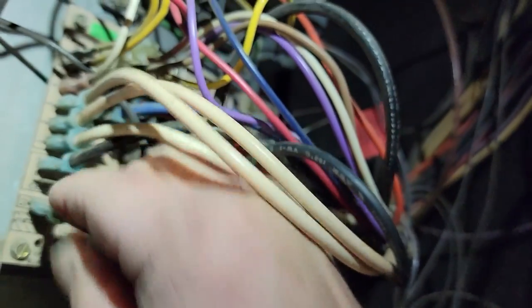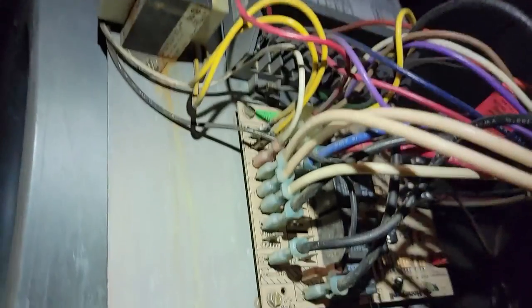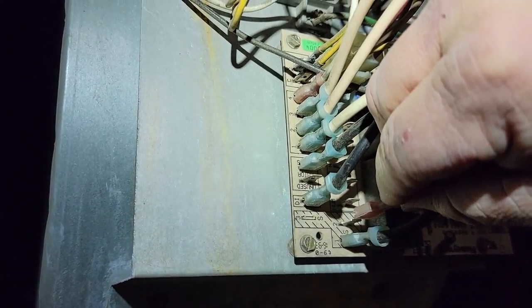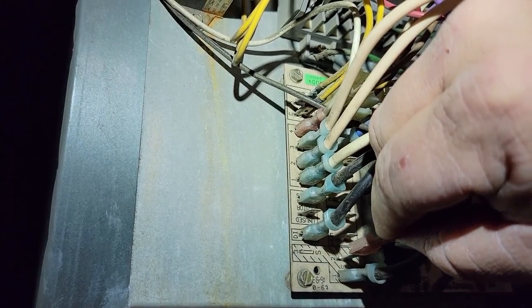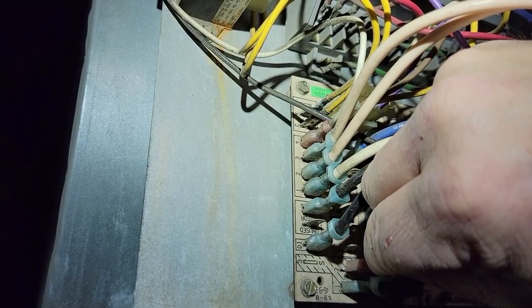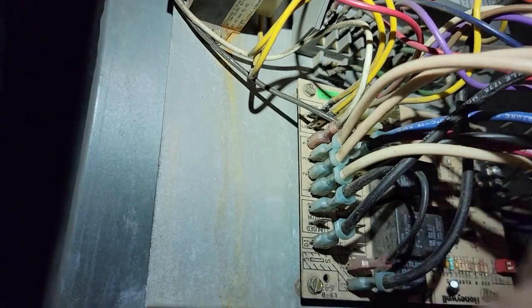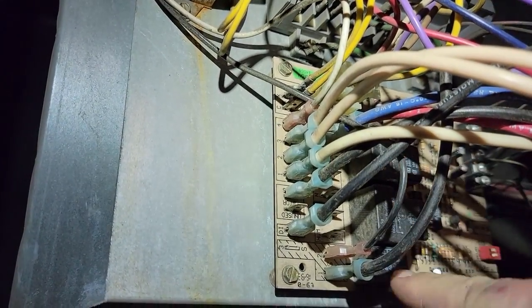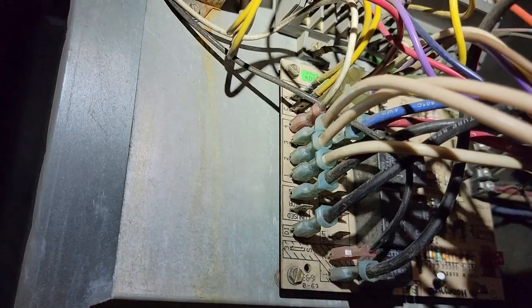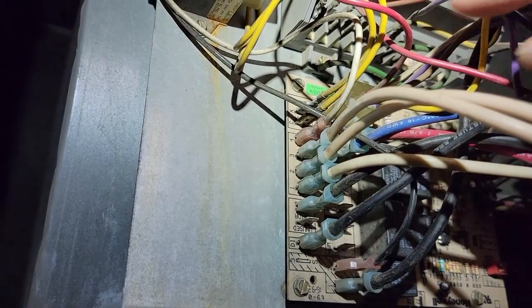Just try to click. You've got to use your ears. This is the 24 volts right here. The door switch is kind of jammed shut there. Notice when we unplug it, you can hear the relay — and I think you're also hearing the draft motor relay. Hear that click right there? That is most likely one of these three relays.